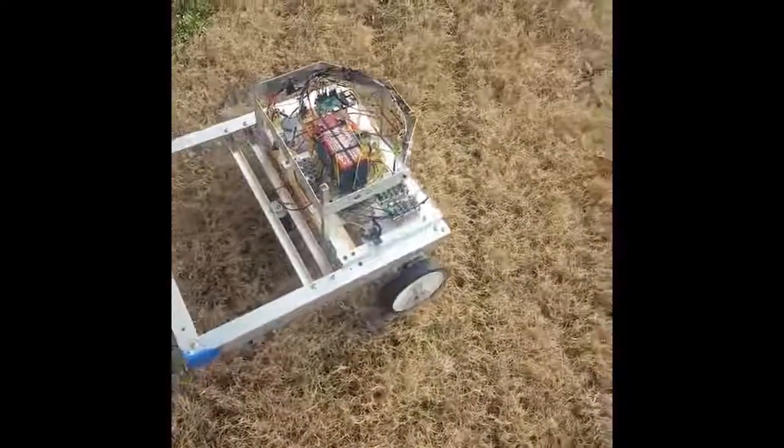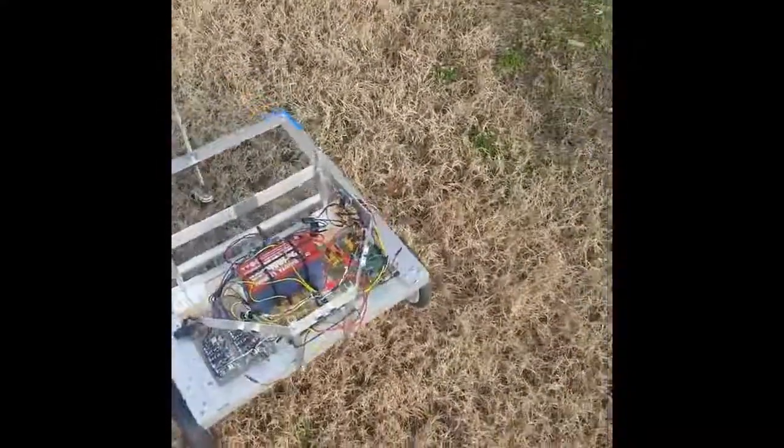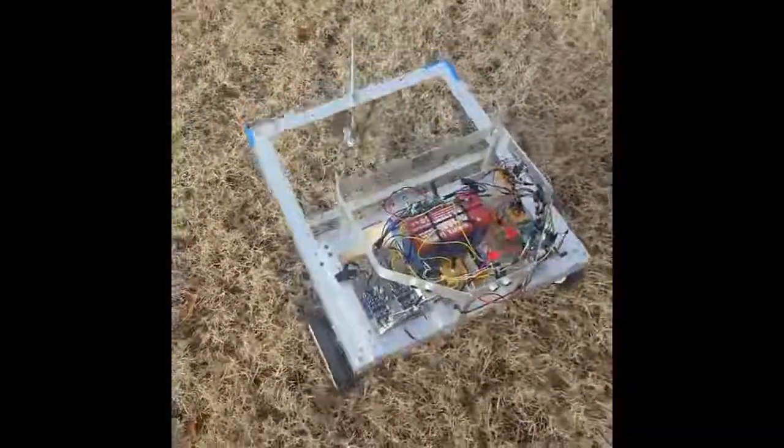Another couple of things about the mowers that you can purchase. I've been looking at the new Terra that's out there, I think is what they're calling it. If you look at those things, they run very close to the ground. What I found, I had mine originally built, the chassis was 4 inches off the ground. I just drug grass. I could not move in thick Bermuda. This thing, even though it's off the ground completely, I think it's sitting somewhere around 7.5 or 8 inches above the ground. And then I have the motor for the actual blade dropped below. It's still in thick Bermuda, has a rough time. Zoysia, it has a hard time.